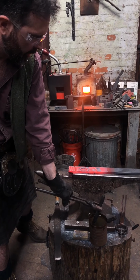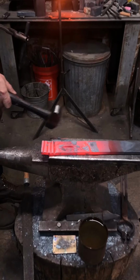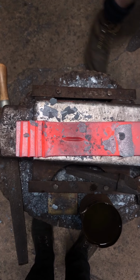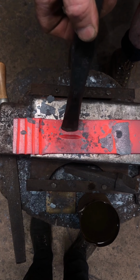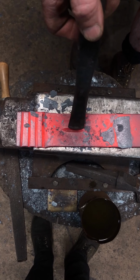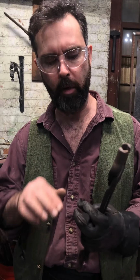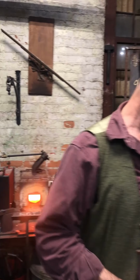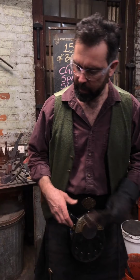Right, what I'd like you to have a look at there, Jess, is the shape of the orifice that's forming. So you can see how the tool itself very much dictates that. So I widened the slit a little wider, and the other thing, if you have square edges on this, you get this weird rag. So you can do round edges on your chisel, but you're going to get a weird rag. So this kind of slitting style is good when it comes to things like narrow eyes. So have a play.